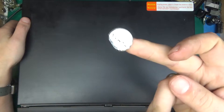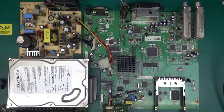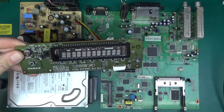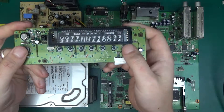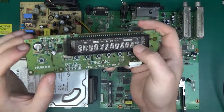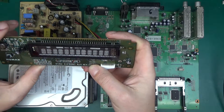It's all void right now. Let's clean this up a little bit and take the boards out and have a look at what's on it. We've got a few boards and components. This was the front board under the flap — just a USB board, nothing active on here. Here is the beautiful front panel with a VFD display. Over here we've got a super cap: 0.22 farad at five and a half volts. There are also a few tactile switches — single pin, two-pin rather than four-pin — so easy to desolder if you're in a pinch.